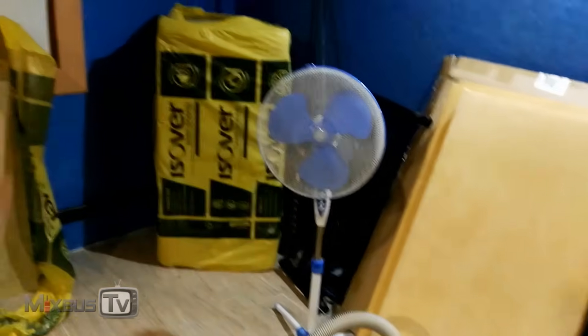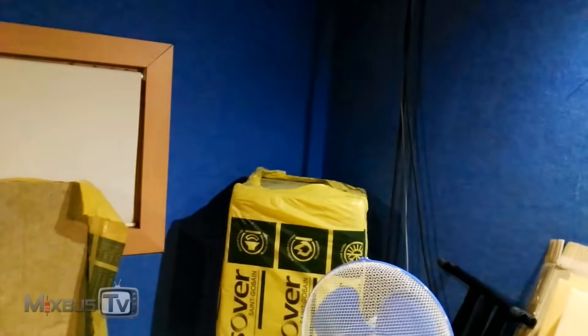That's the first move to solve a potential null problem in the listening position or anywhere else in the room. Second thing is treatment on corners. I have slanted corners already — you can see those were super chunks. The 90-degree angles, especially corners one through four, but also all the 90-degree angles in your ceiling and even floor-to-side-wall junctions — every 90-degree corner is where frequencies are going to build up. That's why you see super chunks and more material being used in the corners.